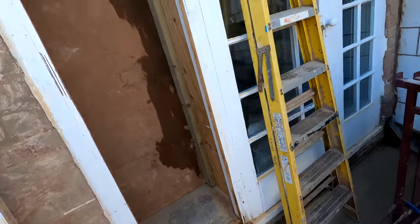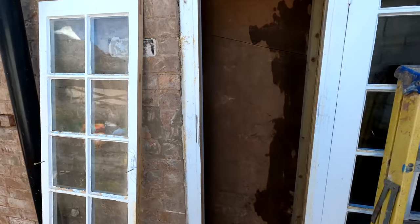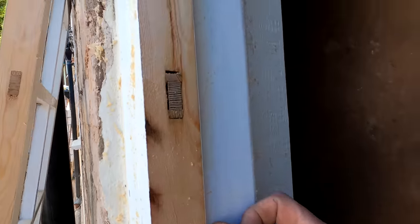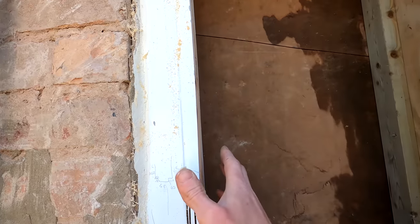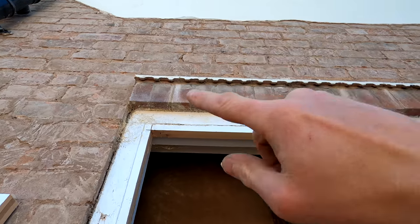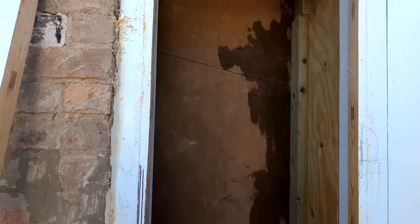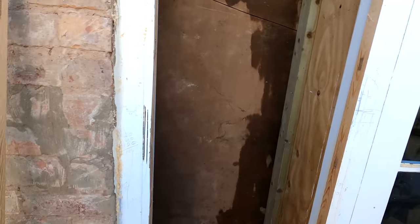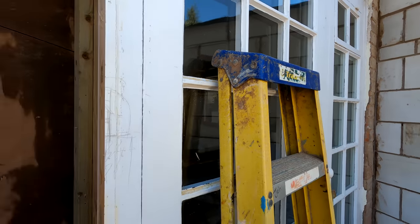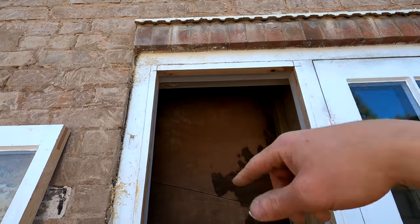So the hole is done — you've just seen me cutting around the perimeter. Our frame is here but this frame that this was actually sat in was recessed into it, so I've just trimmed around to get this out because, like I mentioned, this frame is effectively holding up the brickwork for now. We're going to get some strong boys in now, just get a couple of those in, and then we can remove the rest of this frame and take that out completely. We are going to be leaving this one in because obviously the door is fixed to that and we need to keep the door in for now for the clients — just a little bit of light through into the room.